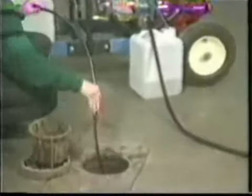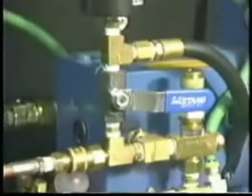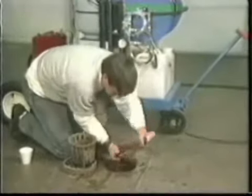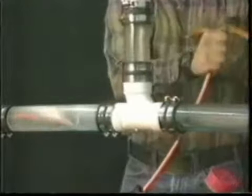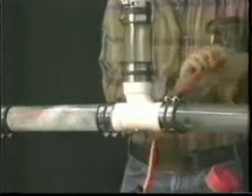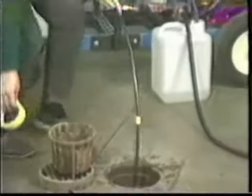If your jetter head is still blocked, move the pulse control lever on the 10 and 12E to the vertical or open position, which reduces pressure to about 300 or 400 PSI and deepens pulse action. Keep the pulse eliminator in the horizontal position. If operating the 2200 series, the pulse generator should be turned clockwise all the way in for pulse generation. Repeat the procedure of forward pressure or rotation while the jetter is set in these positions. If you feel you are still making no progress, take some tape or a crayon and mark the hose and check the progress after two or three minutes. If progress is being made, you are probably into hard-packed soap residues — patience is necessary, as travel time of six inches per minute is typical in these situations.